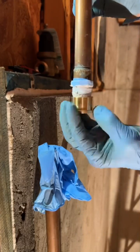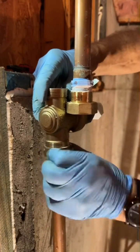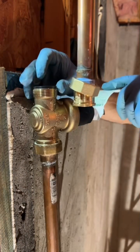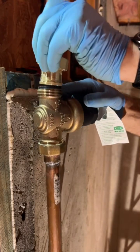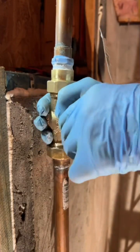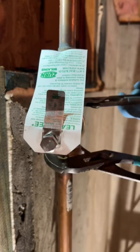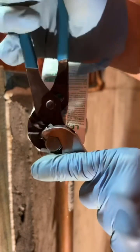I am just not comfortable removing the housing off of a brand new valve so we can install it the way that we got the old valve off. So you can go ahead and get yourself a double union PRV. Of course it has to be the same brand, and you need threaded adapters so you can use your old male adapter on the top plus the old nut on the bottom.